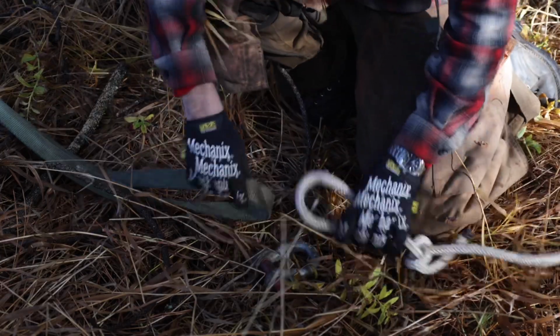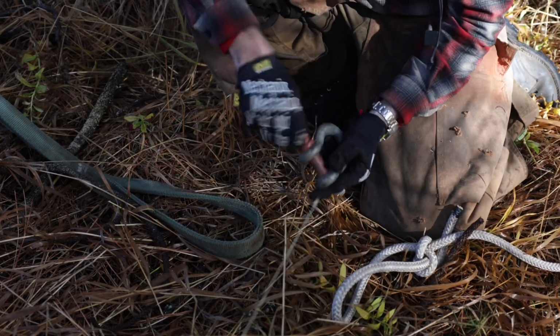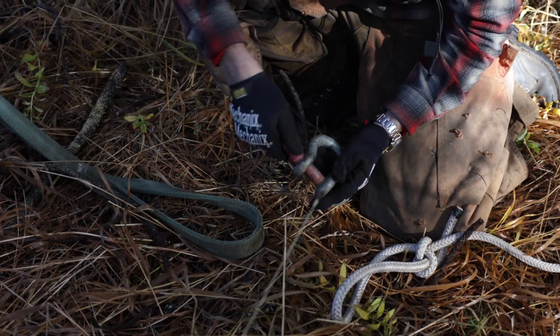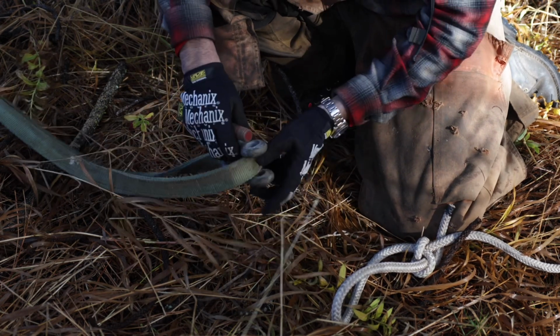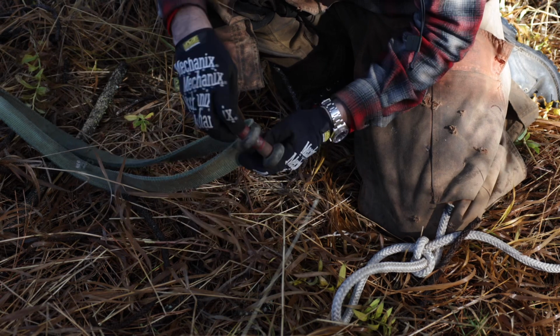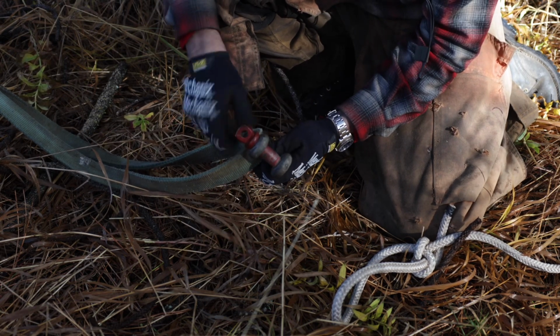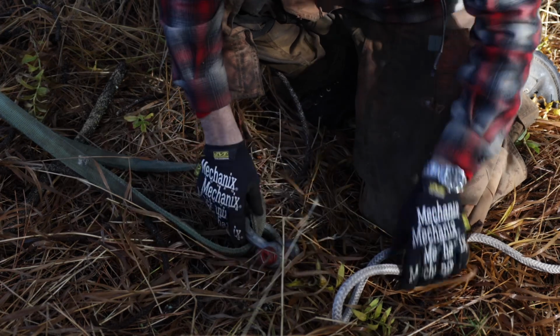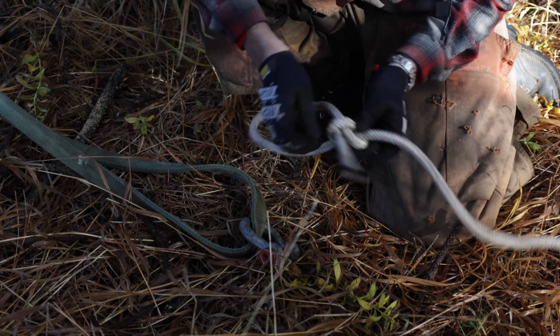Now to connect our choker to our bull line here, we'll use a shackle. Now you wanna avoid connecting ropes together, rope to rope, if you can. Some abrasion problems there. So this is the way to go here. Okay, so now to connect the bull line, B-U-L-L, we're gonna use a bowline.